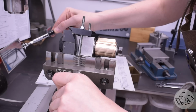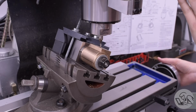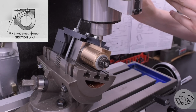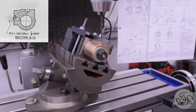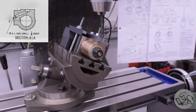And yes, the angle markings are on the back in this setup because it was necessary. This table doesn't angle the same amount in both directions. Stop typing your comments. I'm going to do the main exhaust passage first because it's the easiest. This is a straight shot at a weird angle from the steam manifold through to the port face. I start by milling myself a flat spot, and then I bring in the drill prepared to drill this through.